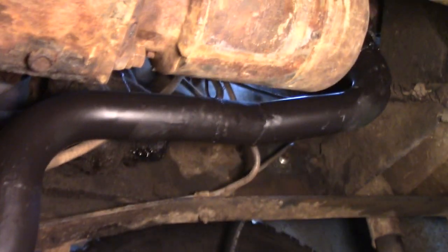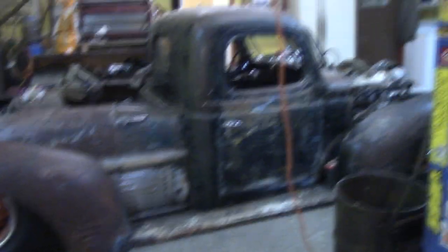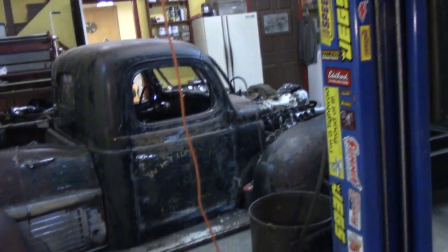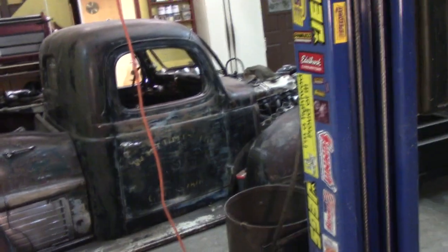You might notice on some of my welds up here on this exhaust pipe that I knocked the welds down a little bit with the grinder, and that's just something I almost never do. This one I didn't, but a couple of them I did up here. On this old rig over here, I don't think I ground down any welds because it weakens your welds, especially when I'm welding on the frame.